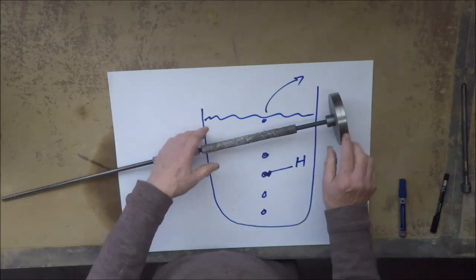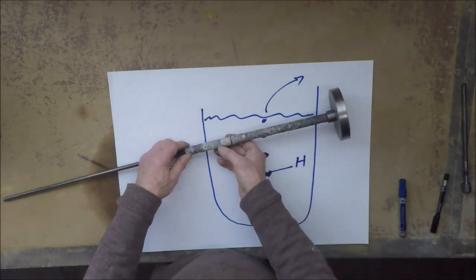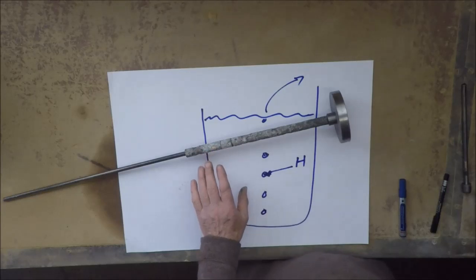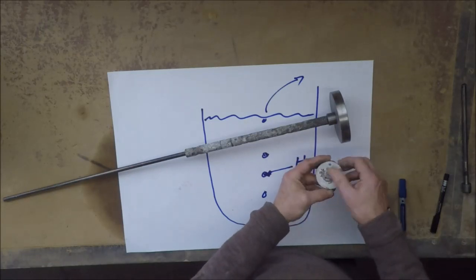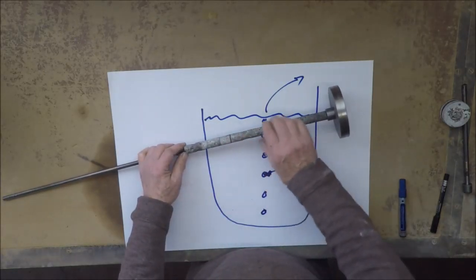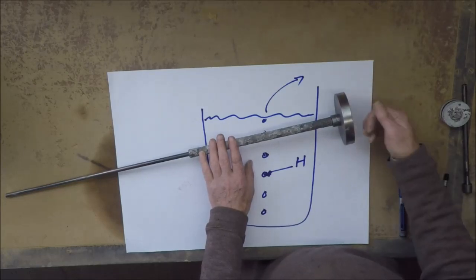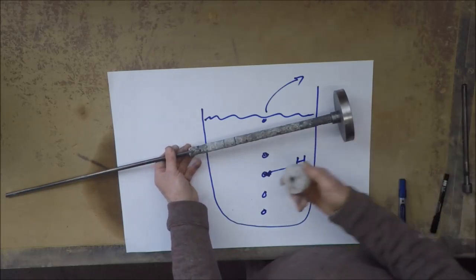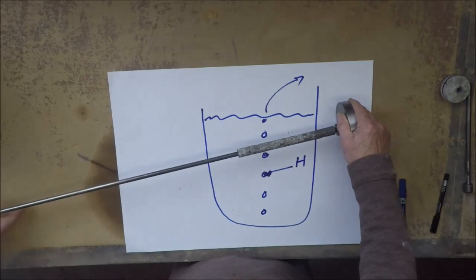The stainless steel tube takes a 3/8 UNF thread so I could screw everything together. These three outer pieces are simply a protection sheath — if the aluminium gets at the tube it'll cut through it in about 30 seconds. So I use a mild steel sheath that's been oxidized by heat and then painted with a boron nitride wash to help protect it. Before use I will oxidize it at dull red heat to make certain it's got a good layer of oxide, and then paint it with this boron nitride wash — the only problem being it's rather expensive.